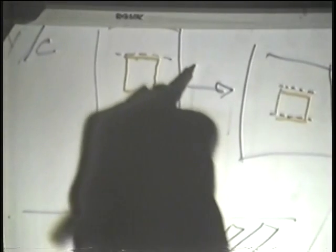Now, you feed that into another VCR, and it'll be delayed again. So all of a sudden, our Y signal is 2 lines or 3 lines or 4 lines above the chroma. So by the time you got to the 4th generation, it would look pretty funny. Here, our Y information ends here, but our chroma is still going on down below the picture. And for one generation, probably you never noticed the difference. But if you're going to get serious about editing, you're going to edit probably 3 generations, I would think. The original, and then another thing, and then you'll make a copy of that, so you're into 3 generations.